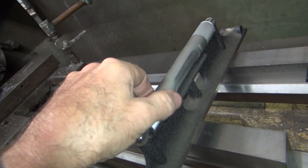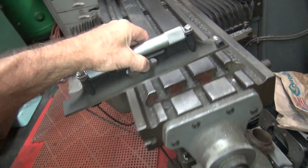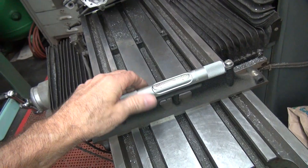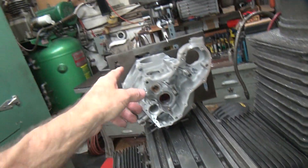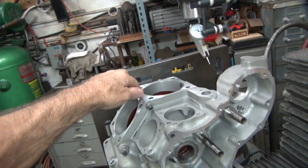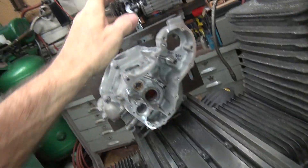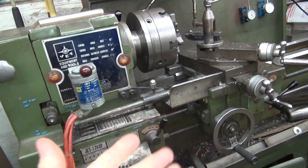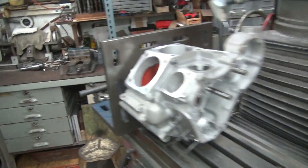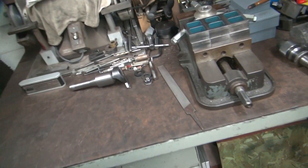Twisting is what you're worried about. Being tilted side to side or front to back makes no difference — the twisting is what matters. This corner is way low, so if I adjust that it should make a difference. The reason my lathe's floor is caulked like this is because the floor in the shop is cut at an angle for drainage. Now in a lathe you don't do anything — the part turns, not the cutter. On a milling machine the cutter moves, so the part has to be chucked up more accurately.